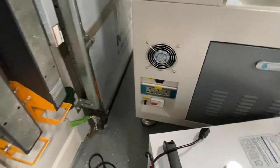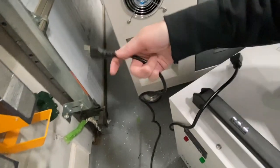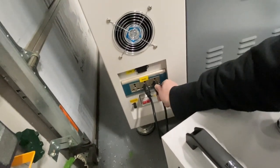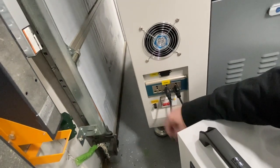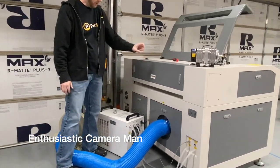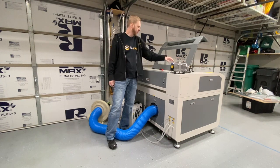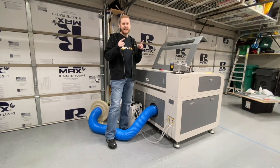So we'll quiet it down a moment. What we've got here is our blower line. I'm going to go ahead and plug them into the spots we want them. I'll put the blower right here in the middle, and I'll put the chiller right here on the right side. Make sure that's all plugged in deep. We'll reserve the next spot for our air pump. We have it all hooked up - we have our downdraft table going, it sucks out all the smoke, and it's going to go outside. We've got it all plugged up to the back of the machine. Next up in our next video we're going to be talking about the air pump, which will help evacuate all the debris from the tip of the laser. This is Daniel, and as always, don't just own your CNC - dominate it.